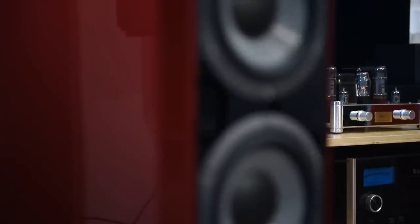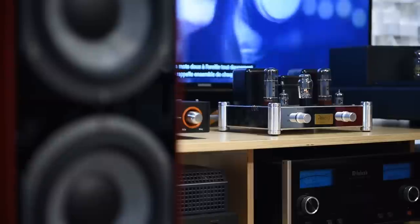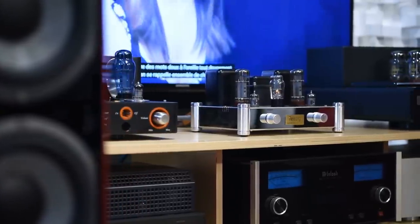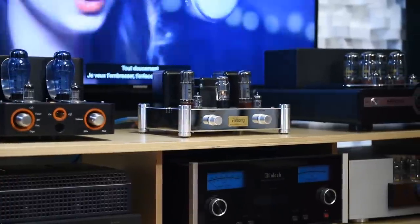Now, some of you might be curious, why would I say the sound difference between the A10 and A12 is not really big? You're talking about 12AX7 versus 6N2J tubes. And Mr. Vintage actually opened up the tube amp and measured it. He found that the 12AX7s are actually getting only 6 volts, like the 6N2J. Now, 12AX7 can handle more voltage than that, and we wonder if it would sound a lot more different if they built it closer to the 12AX7 max voltage specs. Who knows? But the good news is, you can spend a lot of money on the 12AX7 if you want to, since it will most likely last almost forever due to it running at way lower voltage.